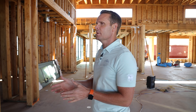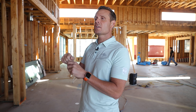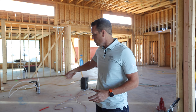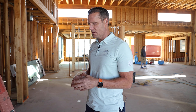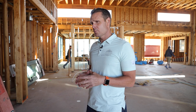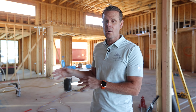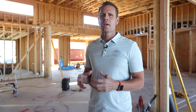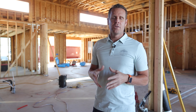Because it takes a lot of time to install can lights — anyone who's put in low-voltage lights and can lights throughout a build knows there's a lot of coordination in lasing or straight-lining all those cans — what we do is mark on the floor at the box walk where all the fixtures go and all the can lights. That helps us lay out ceiling treatments, understand if we have to move any, finalize the ceiling design, and make sure the acoustical ceiling design accounts for where all the cans go. Then when we sign off and release to the electrician, they can install everything one time — done. Everything's been approved by all parties, and we can rope the house and move very quickly.